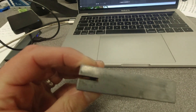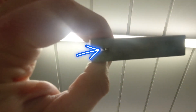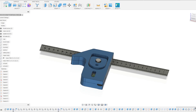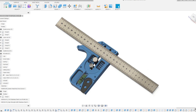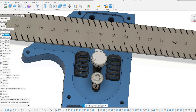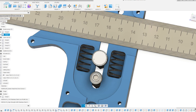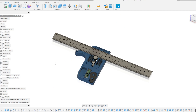You should just be able to make out there are two wear pads, and they need to be exactly the same height — if they're not, your ruler won't sit flat or square. You have to get in there with a file and file them down. With the two-part construction, you should be able to file that down a lot easier: measure it, slip it in, check whether it's square, and file down another one if needed. That's one advantage — though we might not go with that.